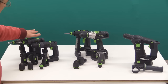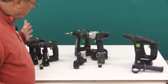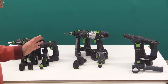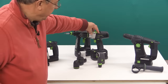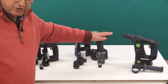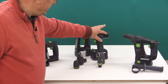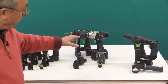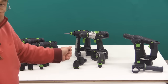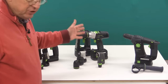I've now split these into three groups: the small ones, the larger ones, and the odd one out which is the hammer drill. Now let me whistle through the characteristics so you can compare them. Brushless motors: the C18, PDC-18, and BHC-18 are all brushless — three brushless machines. The CXS and TXS are not brushless. The advantage of brushless is that brushless motors consume less power, the motors do not get as hot, you need fewer vents so less dust gets into the working parts, the machine lasts longer, and your batteries will last longer too since battery life is dependent on the number of recharges.